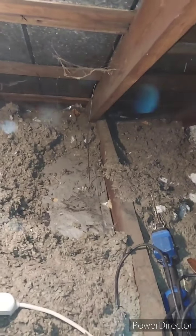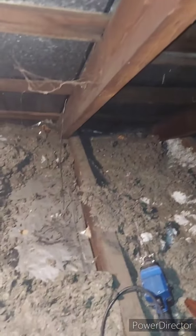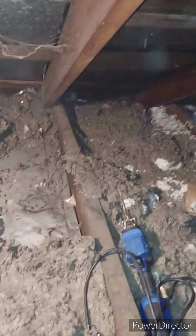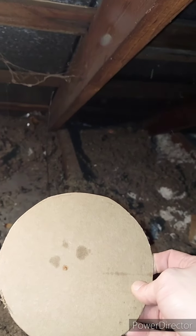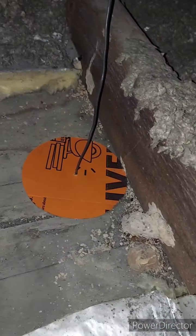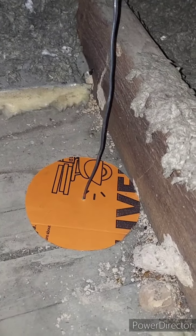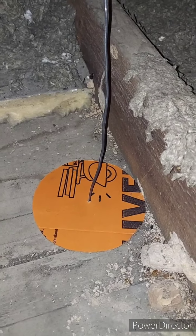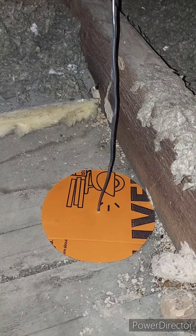I'm going to get a knife and cut that insulation, and here's a little template for my can light. I'm going to trace it and cut it out. I'll trace around this template, get me a line, cut the hole out, and move on to the next one.